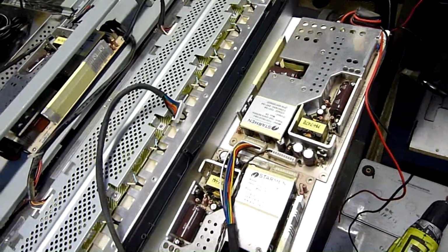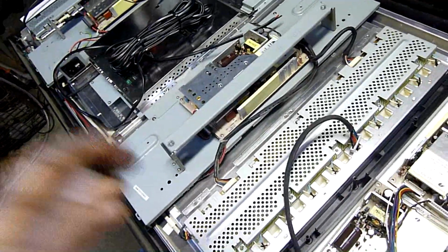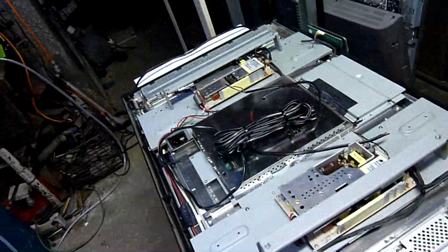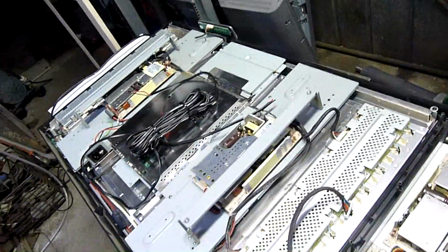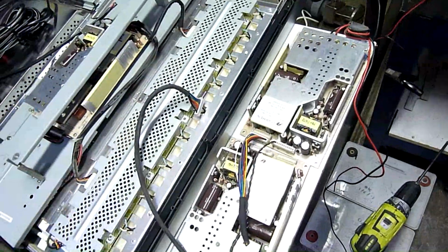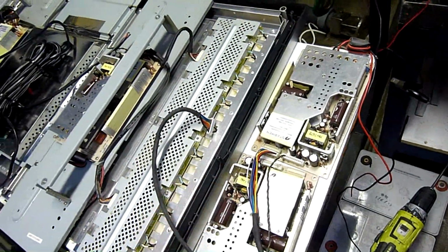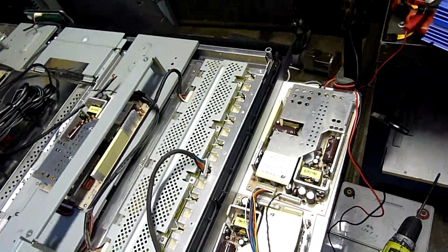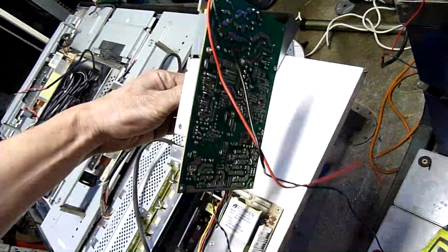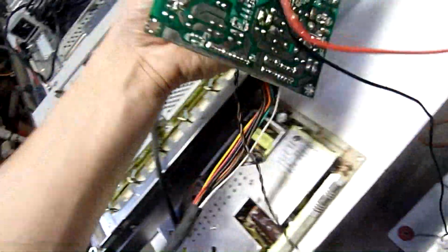Obviously I don't have a T-con for it, so it's a different panel and a dead T-con anyway. I might have a pair of inverters for these as well. Digital board could be a problem, but if it's just a power issue I can fix it at least once, but we'd probably just go out and buy a new panel if that's the case. Although by then, if it dies in 12 months, I'll probably already have another replacement panel sitting around. So that's very good. Anyway, I'm going to look at these and work out the pinouts.